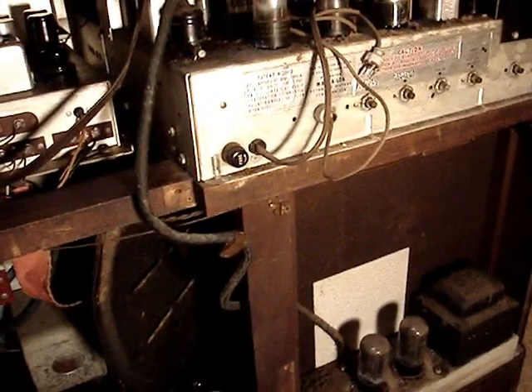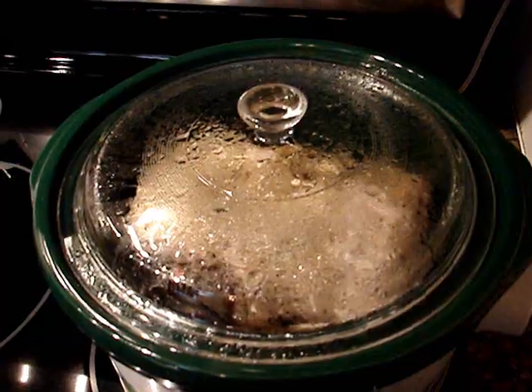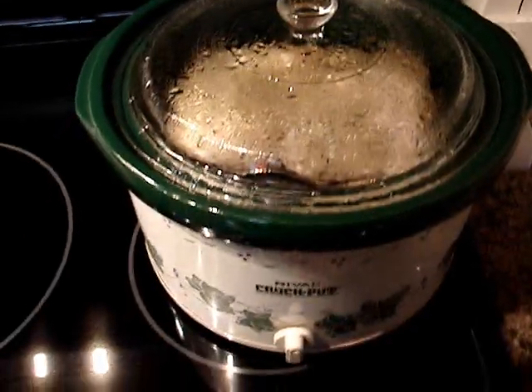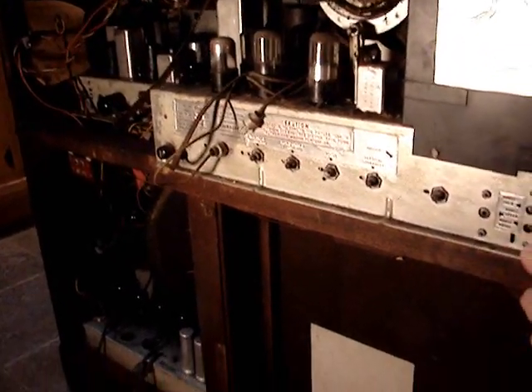In order for me to get this out — and I'm pretty sure it's going to have to come out the front — I've got to take this off so that the antenna assembly goes with it, because that's soldered on the back of this. This obviously comes off and unplugs here. While I'm working on this, the roast in my slow cooker crock pot is starting to smell very good. It won't be done until late this afternoon. Here's what I got done in the back — I've removed the rectifier and transformer assembly power supply. These two screws here are attached to the chassis underneath from the back. Now I'm going to go to work on the front.